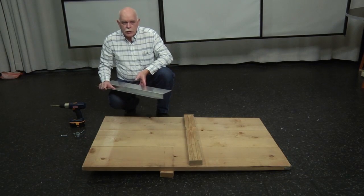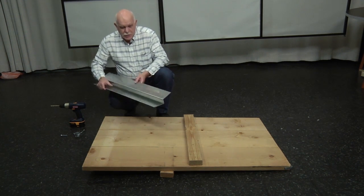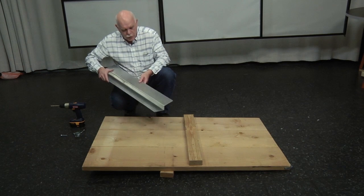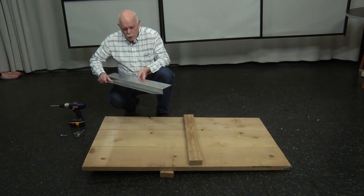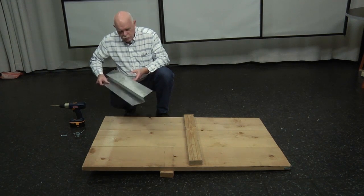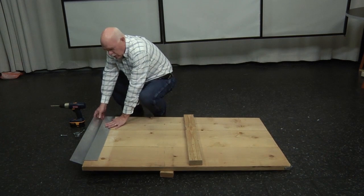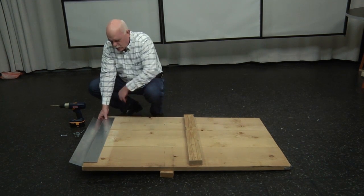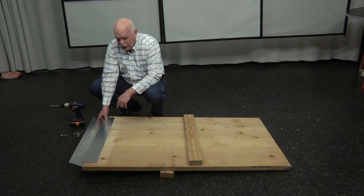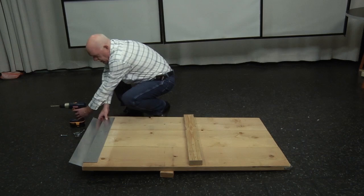So what is not intuitively obvious on building one of these wheelchair ramps is mounting the top. This is a standard top. It's made out of aluminum, so it won't stain your sidewalk or your porch. And so to mount it, you center the top bracket across the 3 deck boards. You notice that there are holes already pre-drilled in the bracket, which is used as a template for you to drill your holes through.